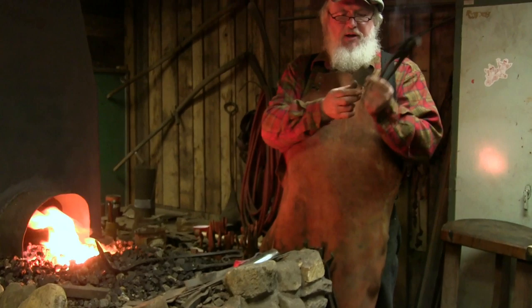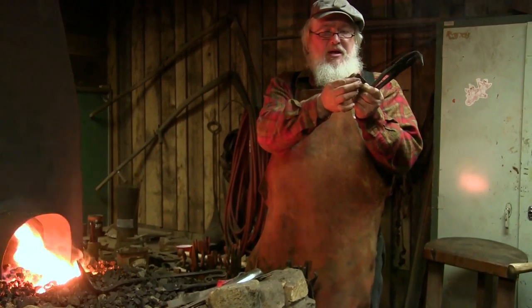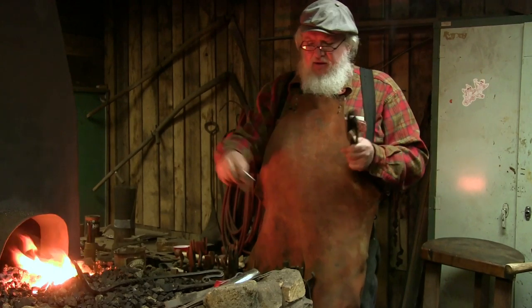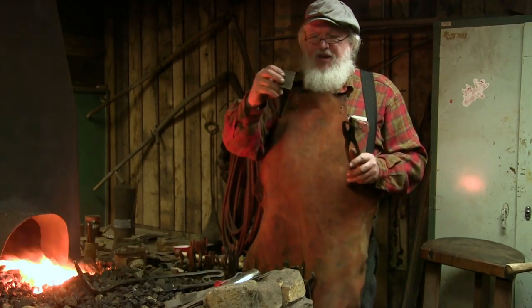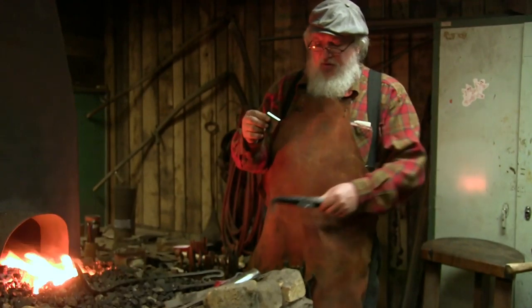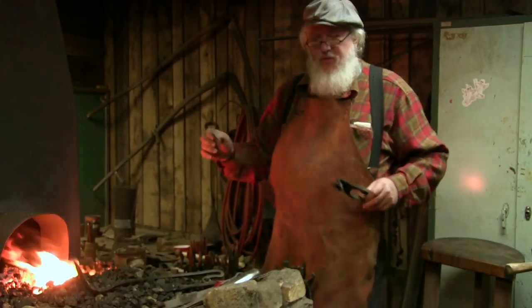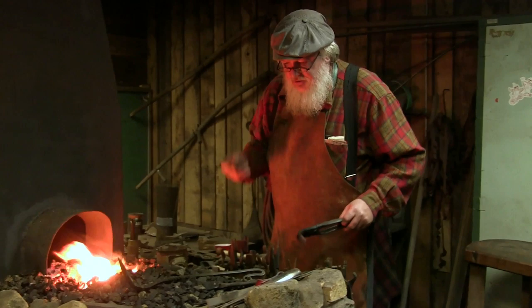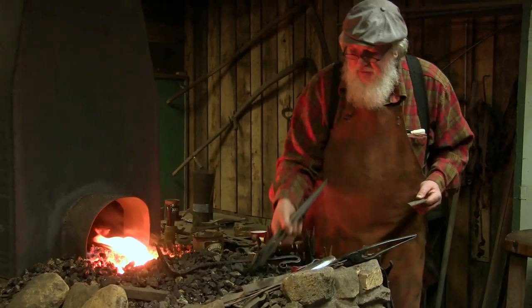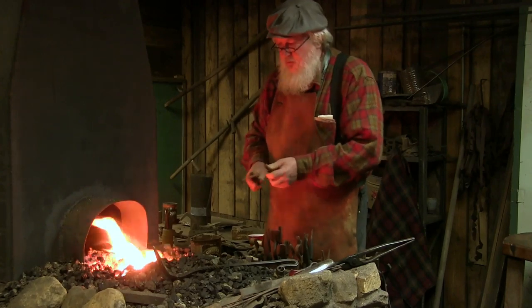And this is the bit. What I'm going to do now is take this piece and draw a scarf down on the edge a bit so that I can insert it into that V created by the split we made. And then we'll hammer that closed on it and we'll heat the whole thing up for another forge. So I'm going to taper this and then we'll clean the fire out. And we'll make our final weld.